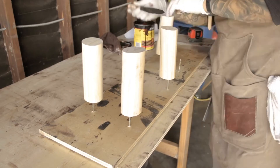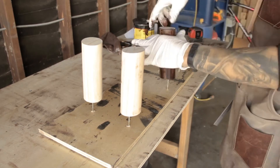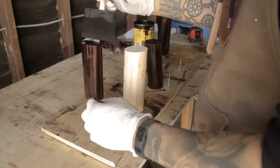For the legs, I just lightly pressed them into these screws I drilled through a scrap piece of wood. This seems to be the most efficient way to get stain all around these dowels without smearing it all over the place.